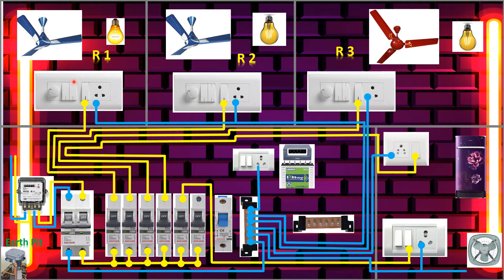Now we'll take this phase for the bulb, because we are not going to use the inverter for the lights. We take the phase directly — from here it goes here, here, here. The phase came to the bulb. Now we'll take the neutral from here to both the bulb and the fan. In the fan we will connect the inverter output.